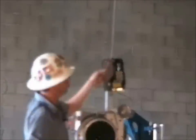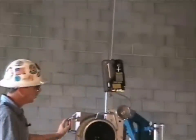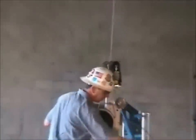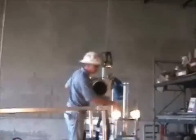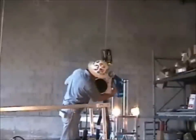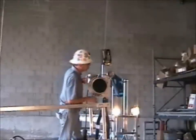If I try and force this right now, there's a pin inside that's designed to shear off. As you're going in the up direction, you should be checking a couple of things: that you have enough wire rope to reach the ground or your lowest drop, and also that the wire rope is exiting the hoist at the same rate that it's entering it, just to make sure you don't have a rope jam.